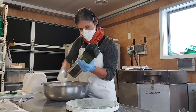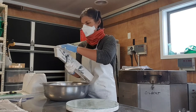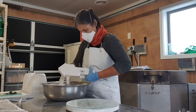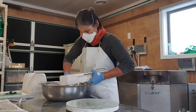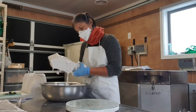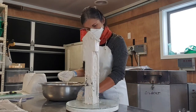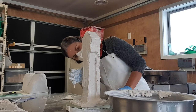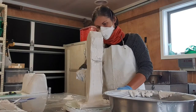The only consideration is that the glass is a lot heavier than my wax. This piece is about five kilos and I can only hold that in my left hand for a certain amount of time, so I get it down onto the sculpture wheel a little bit sooner than I would with a wax model. I've sped up this process so you don't have to watch me dribbling the plaster-silica mix all over it. This is the first layer finished, and then I'll build up another few layers until we end up with the finished mould.